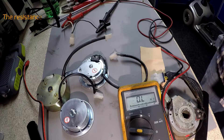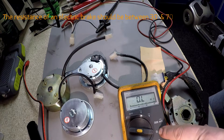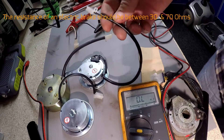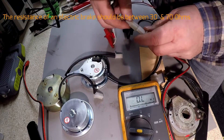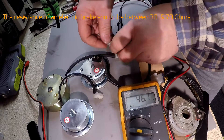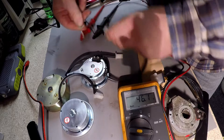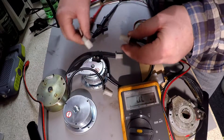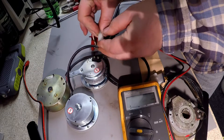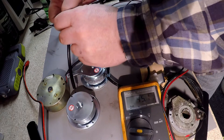Some people will actually check the resistance of the coil. To do that, you'll need to set your multimeter to the ohms setting — the horseshoe symbol. We'll try this electric brake here, the one with the micro switch on it. We stick the probes in and we get 46 ohms. It is a new brake so you'd expect around that figure, but it just depends on how the manufacturer builds their product — it could be a different resistance. It's reading 46, 45 ohms.